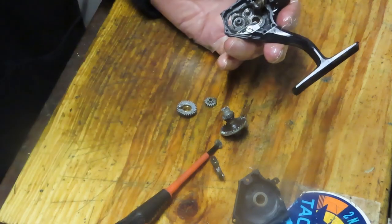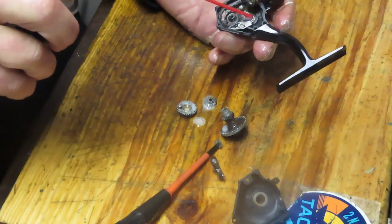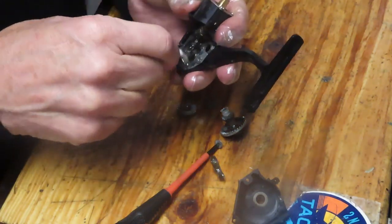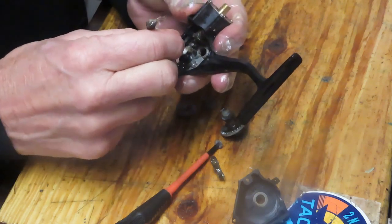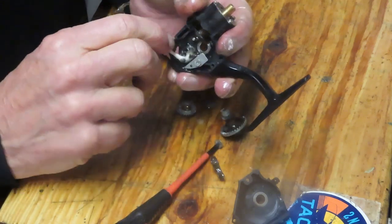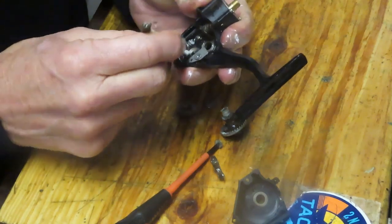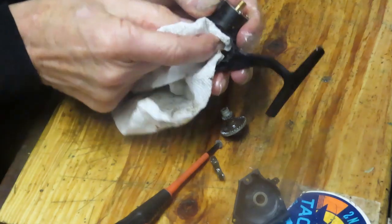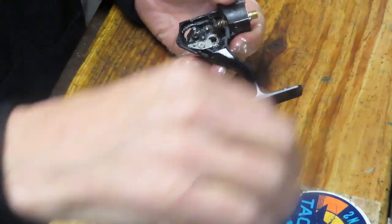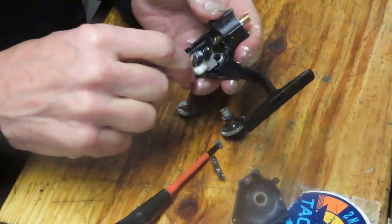We have all our gears on the table now. I'm going to spray the gears down with some penetrating oil to loosen the grease for cleaning, and do the same inside the case. I'll go in with the least abrasive cleaning I can — paper towels and cotton swabs — and get all the old grease out. These reels are not sealed, and trapped debris will only become abrasive, starting to wear on the pieces and parts. You'll end up with a rough-performing reel, or a broken part.